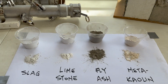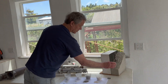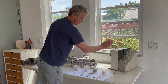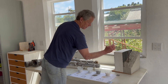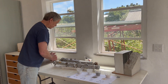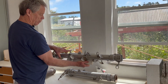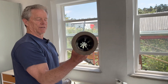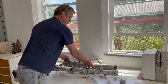This works with all of these supplementary cementitious materials about the same as it does with cement. The construction is four inches of concrete, and the foam thickness can be whatever you want — two inches or six inches — put in place first for better control, then a water control layer, and then ideally a fireproof coat on the outside. Here are two of the inline mixers: one suitable for 3D printing with multiple ports, and these are the blades that do the mixing.